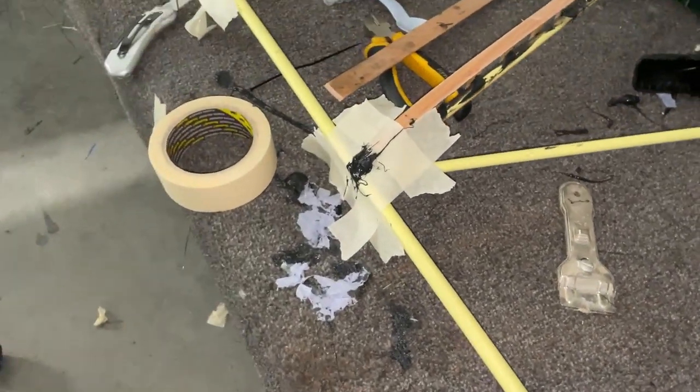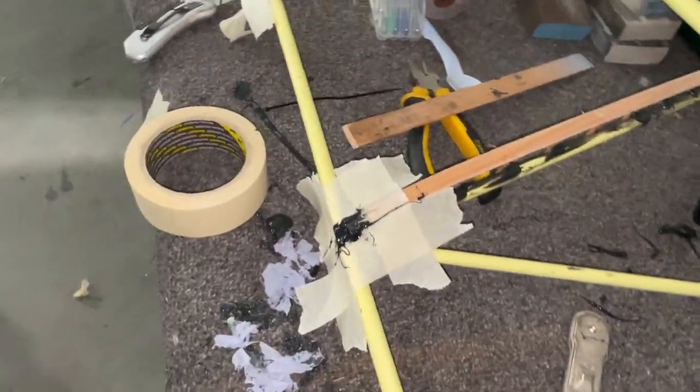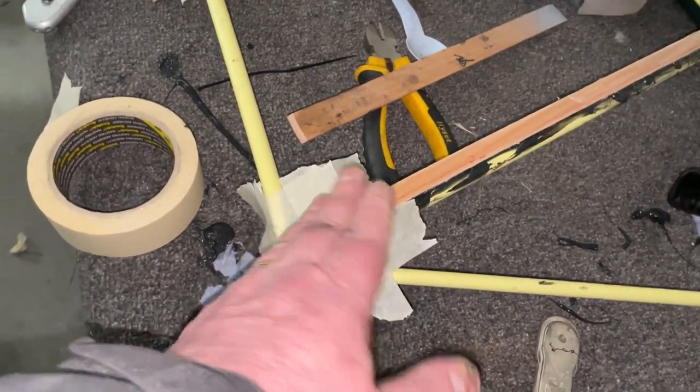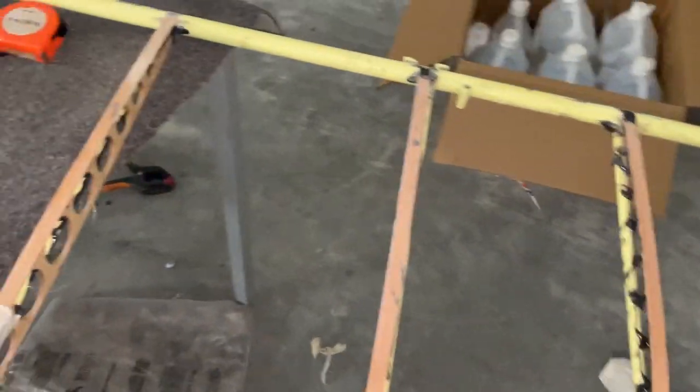So I've done the best I can. I find the best thing to do is to trim back the cap strips a little bit further, and then I'm just forming with epoxy resin. A little bit of a mess, but it's masked. And the idea is we get nice even contours with a little bit of sanding. But that's all going good.